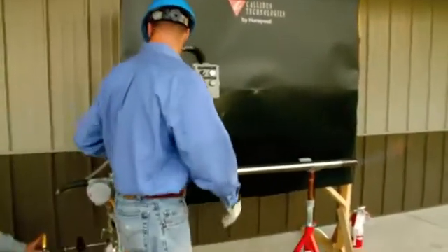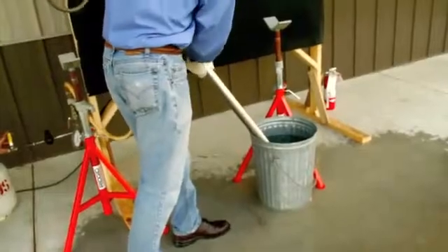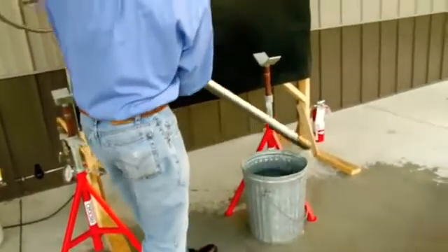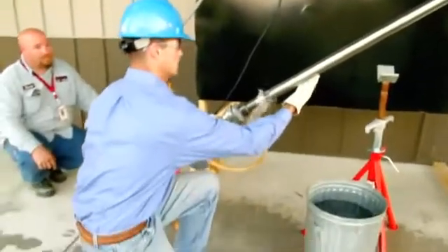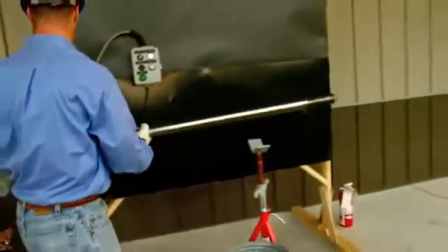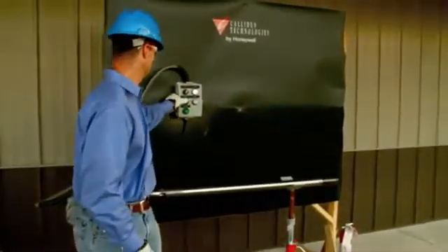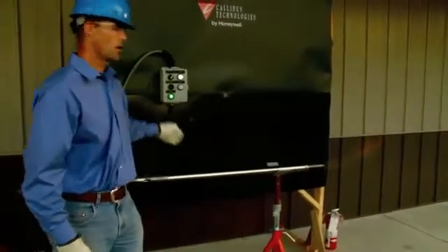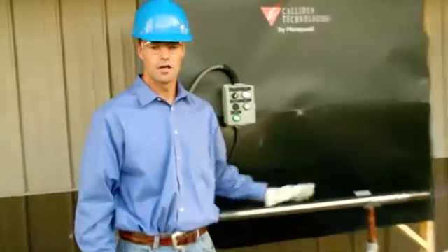Let's try something else. This time we're going to go ahead and give that a really good soaking — making it a little bit worse. We've absolutely soaked the entire internals of this pilot, and that's got to be the worst operating condition you're ever going to see. And again, instantly the ionization rod is picking up the flame with no problems. This pilot is absolutely reliable in the wettest conditions you're ever going to see in your furnace.